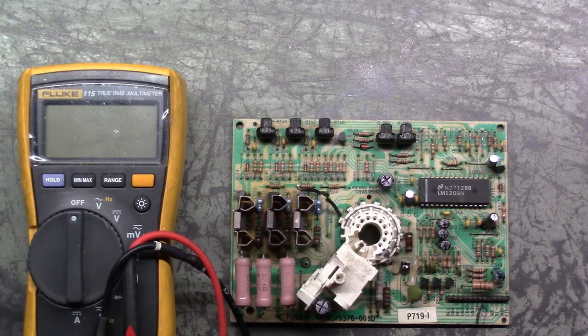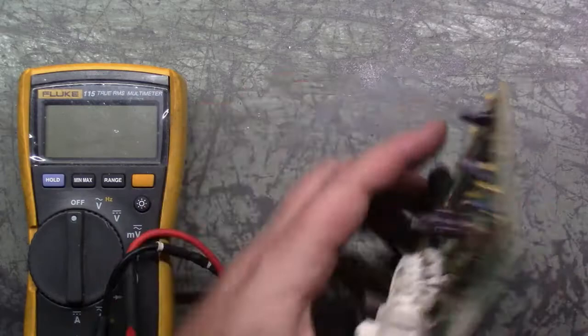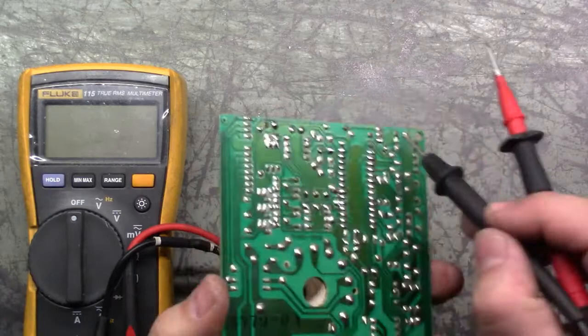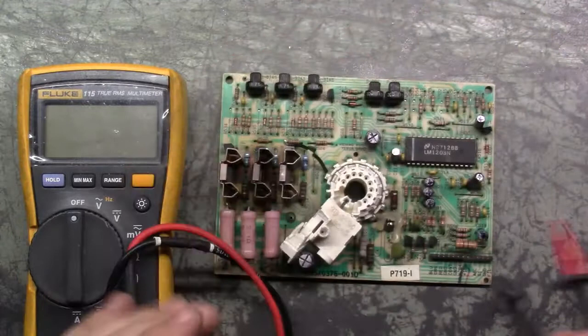Again here, sorry, I forgot to mention that when I actually soldered it in, I soldered those two pads first, the ground plane pin and pin 3, and tested it just to make sure it was good, and it was reading the same with just those two pins. So before I went through and soldered the entire thing in there, I wanted to make sure that it was no longer reading 64 ohms. So that's what you saw me do there. So yeah, now let's get it on the tube, see what happens.